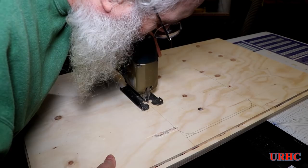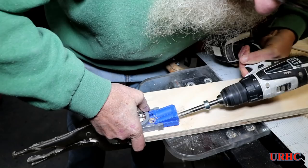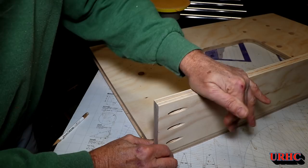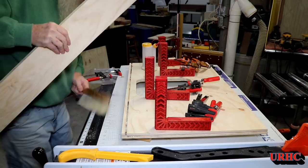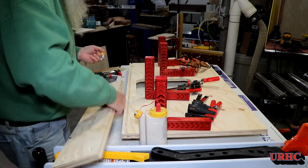A little more finishing up — I have to cut an opening in the top shelf for the sink and plumbing. There's a piece that goes across the back that squares everything up and allows me to mount it to the wall. I'm using Kreg screws as extra precaution, which locks into a groove in the top to keep everything pulled flat together. I decided to do this carcass glue-up in two stages — gluing the back strip in place and clamping it down first before doing the rest.